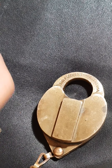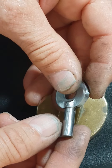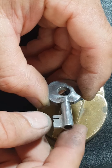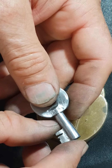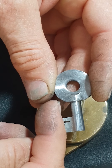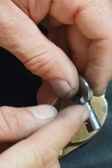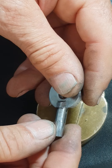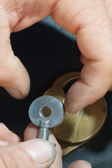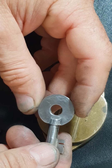Let me give a demonstration of the barrel key that I produced for this lock. This is made out of 1018 cold-rolled steel bar stock — no welding. I attacked this by drilling a hole in here, then defined the bit section height and width, cut the waste material away, and began hand-turning with a drill bit. I defined all the barrel section between the bow and the bit area with my grinder, cleaned that up, and all the cutting on the outside was done with my precision hand grinder tool.